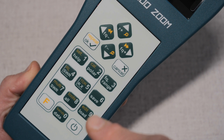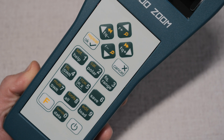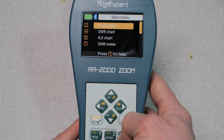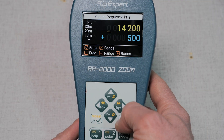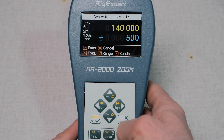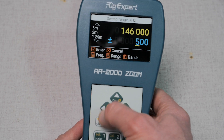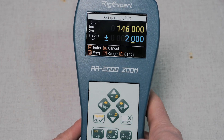On the right are four keys and the power button. This is for setting the frequency and range, saving and loading plots, and viewing data on the graph. With the exception of the range button, these buttons only work when you are on the graph screen. To show the basic operation of the meter, let's first scan a basic two meter dipole antenna. The first step is to set the frequency and the range. There's no menu item for frequency selection, so you'll need to press number three, use the keypad to enter the center frequency and the scan range, and press enter.